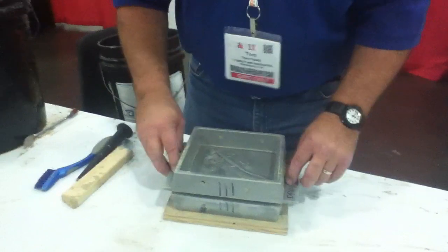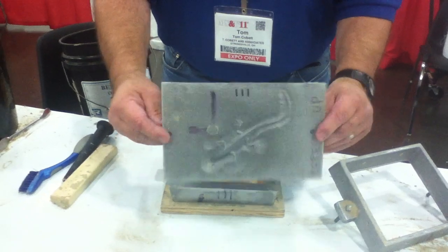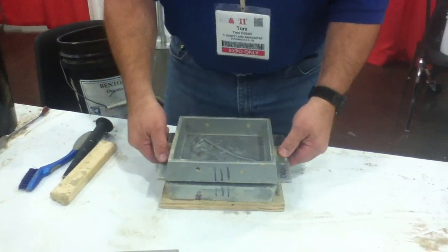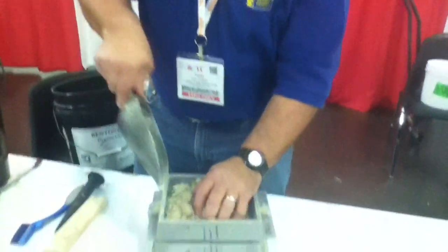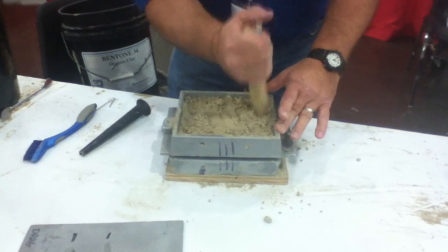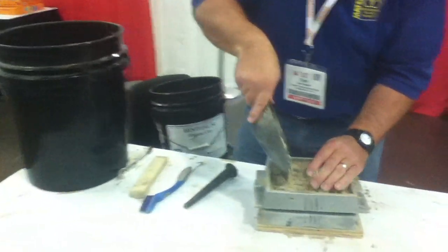This is a pattern that has half of the detail on one side, and the other half of the detail — this has to be a gecko — is on the other side. We call that type of pattern a match plate, very commonly used in industry today. In industry, we can make a mold about every 15 seconds on high production equipment, but I take about two or three minutes to make a mold. We're going to take some sand, put it inside the box, and just pack it into place. The sand molding process has been around for thousands of years, but these materials used in this sand have only been around for the last 50 or so, so it's relatively new ideas.